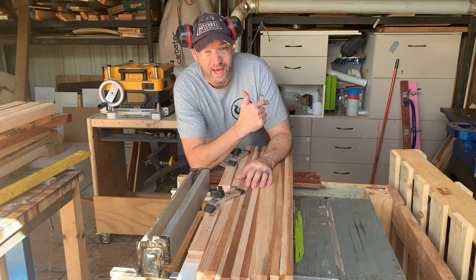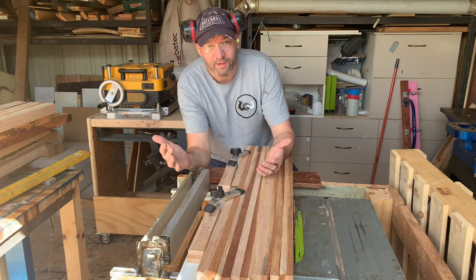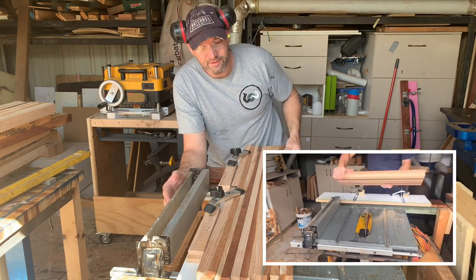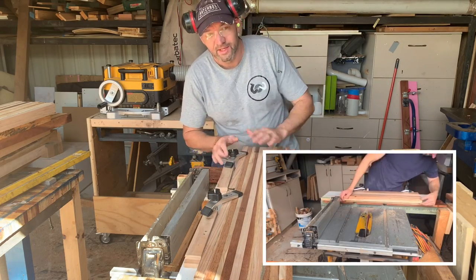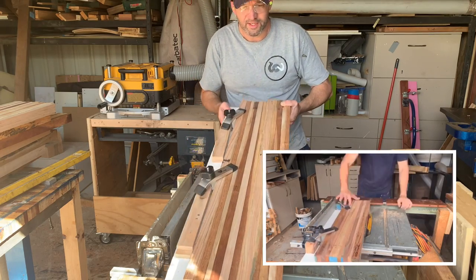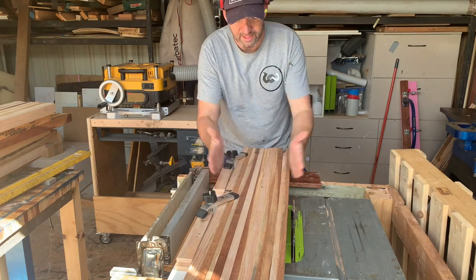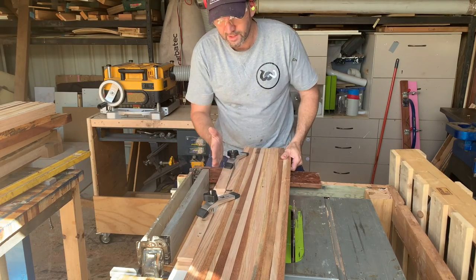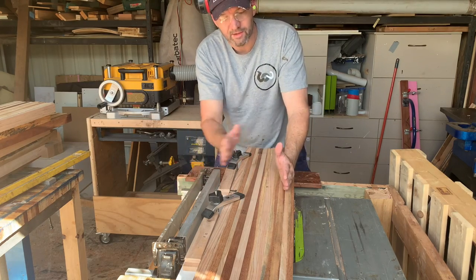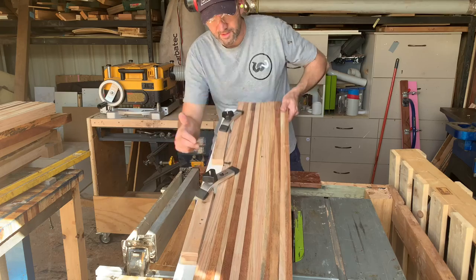Really happy with how the jointer has worked for me. I never would have had one — it was gifted to me and it is absolutely unreal. However, this is how I did it before. This is a straightening jig I've gone with, using the toggle clamp method, so it allows me to put these big slabs on it. It is my straight edge, and that's going to give me my first cut. I can then run it through nice and parallel — cost about 20 bucks to make and it works a charm.